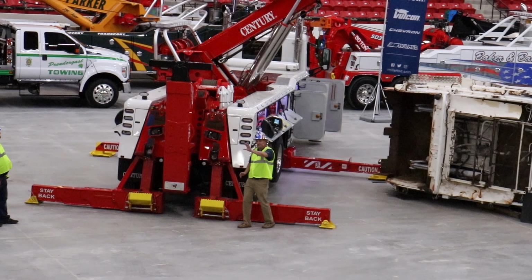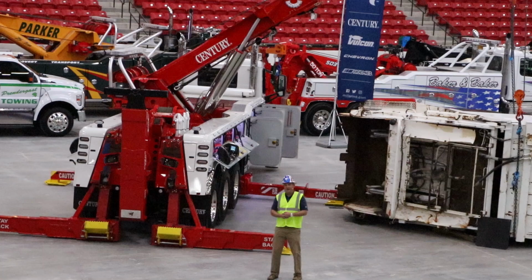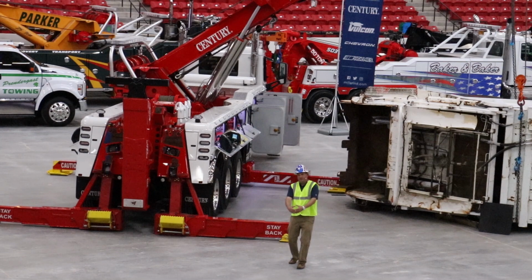It's okay, but if we're winching, we're going to retract these outriggers all the way in. We're going to go out to the casualty. We're going to come back and we're going to neutralize this leg. That's super important. It doesn't matter if it's a 16-ton, a 7035, a V70, V100, heck, a competitor's product. You want to neutralize that leg, not come back to the tailboard, because that's going to keep that outrigger or that jack leg, whatever it is, from coming up and folding up underneath that truck.